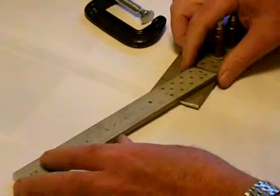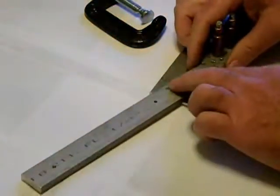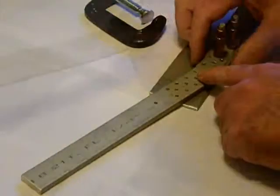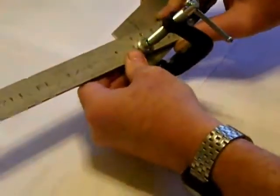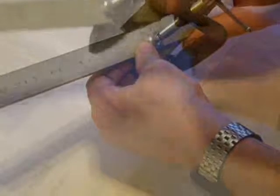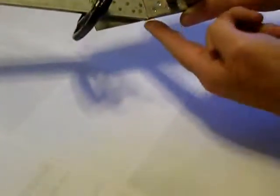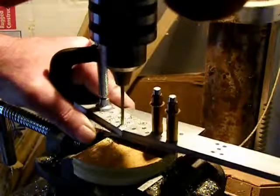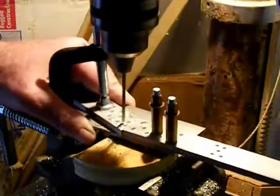The lower mount bracket fits against the end of the lower ascending arm like this. Notice how the top corners are exactly even. Then I'll clamp it together. You'll also notice that the bottom corner sticks out a little bit, but that's okay. Now I'll drill the second set of holes in the side plate and add cleco pins to hold it on.